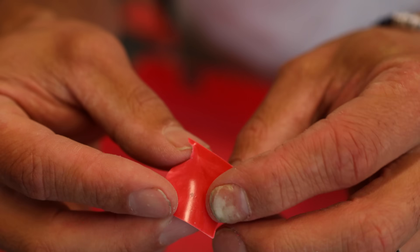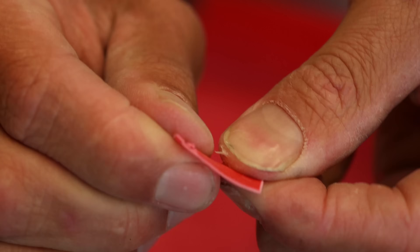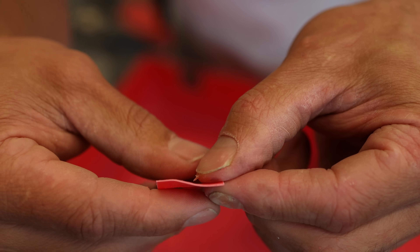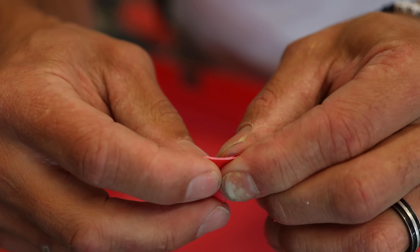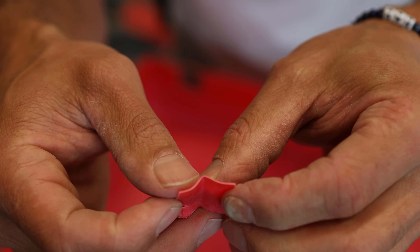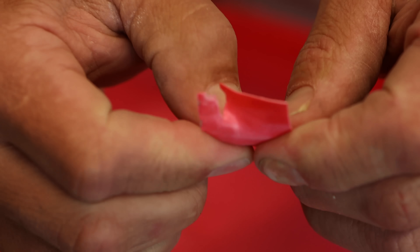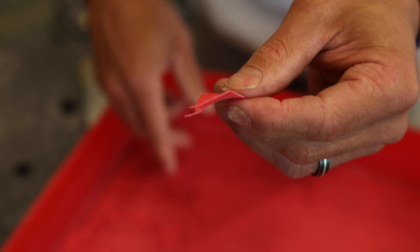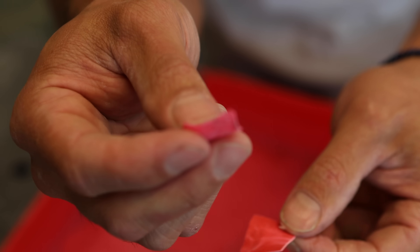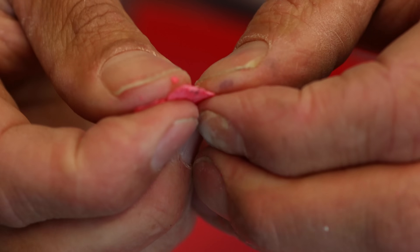Here's how the membrane should look — from a dry area on the side. It has a nice elastic, stretchy feel to it. It's got a nice mil thickness on it — 22 mils is what they want for finished thickness, and that looks about right. You can stretch it and it's all good. But the problem is: this is the stuff that stayed dry on the side, and this is the stuff that was wet on the bottom — and you see, it just falls apart.